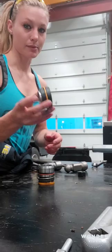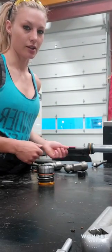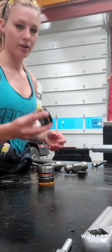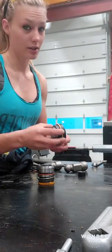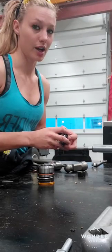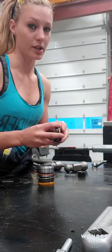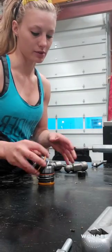The first component that comes off is this — this is the piston. It sits on there like such. You pull the nut off, pull the piston off. That's the seal you'll be replacing. This particular one is unitized, so this black stuff is actually part of the mold of this piston, so you cannot replace that. If that's damaged, you have to replace the whole piston.